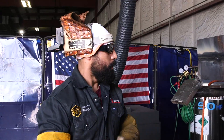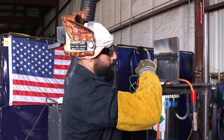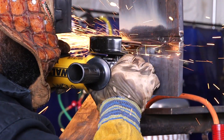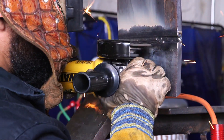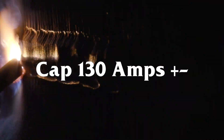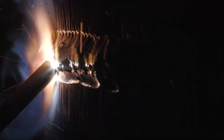Now we're going to go ahead and cap it. We wanted to keep that bottom bevel to use as a guide. One thing that works very well: always grind your guideline. I'm going to grind a line right inside my weld, next to my bottom bevel — that's going to be my guide. Make sure you stay inside your weld. After grinding the line, we're going to do tiny little circles again. On our cap, we're going to use half of our weld — go halfway down to the bottom line that we grinded. Pause at the middle. Tiny little circles — keep them nice and tight.